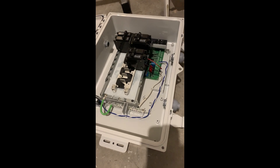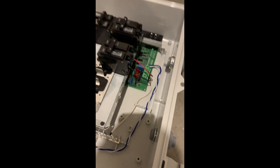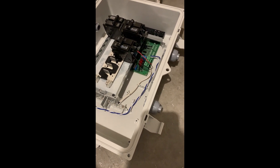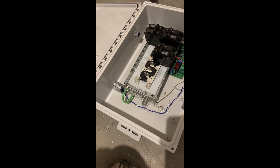I went ahead and drilled the holes — here is exactly what it looks like. This is the conduit fitting; I actually had to drill about an inch-and-a-quarter diameter, not quite the seven-eighths I initially thought. Once you get the fitting in, put the nut on, tighten it, and then plug your conduit right in. When connecting your wires, make sure you have enough slack so you can pull the wire through and connect it — don't run it tight right up to the conduit. Now I'm going to mount the box up to the wall.